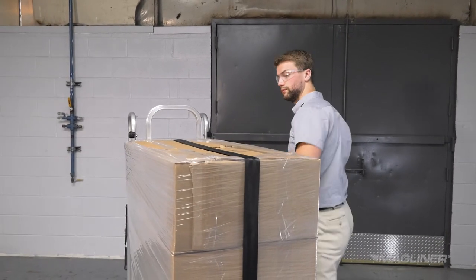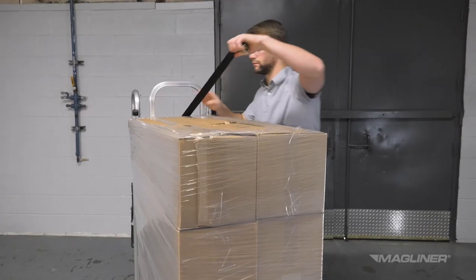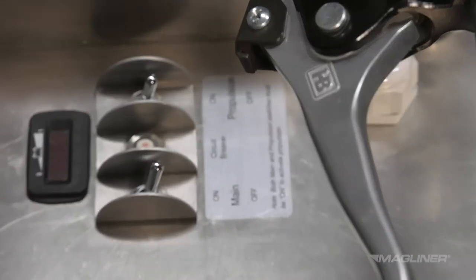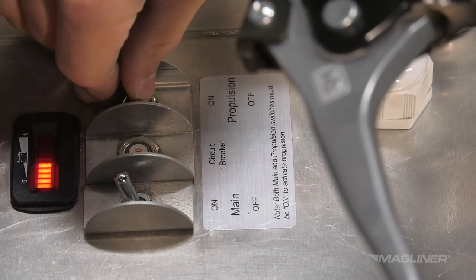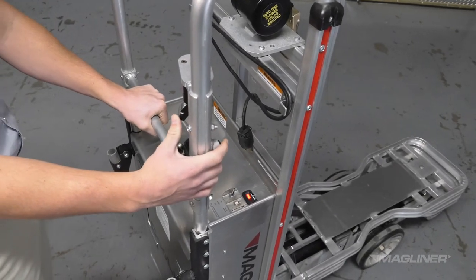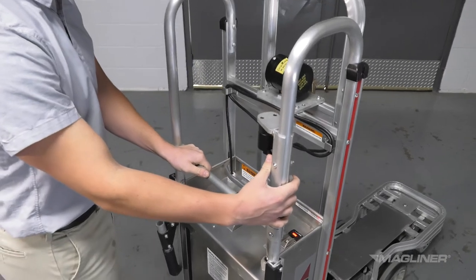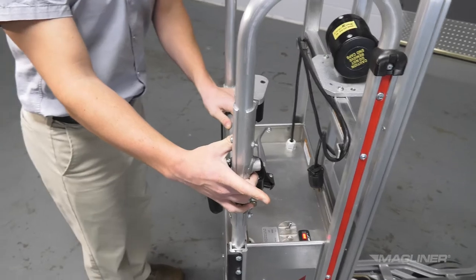Then check to make sure the safety strap is working properly. The strap should pull smoothly from the canister, reach around a lifted load, and the strap tongue should securely lock into the buckle at the front end of the CoolLift. The tongue should only be able to be removed by releasing the buckle. Finally, inspect the propulsion system. Test the on/off switch to be sure the unit will turn on and off as intended. With the unit on and interlock button engaged, test that the unit moves forward and backward with propulsion. Test the interlock button by moving the CoolLift forward with propulsion and releasing the switch — the unit should stop once the deadman switch is released, even if the throttle lever is pulled back. Test the same way in reverse direction.